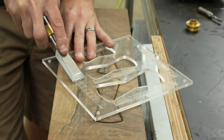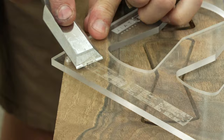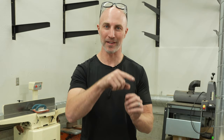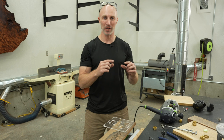I just like to have a nice flat chisel to take the tape off — doesn't scuff the acrylic and comes off pretty easy. There is an important thing to note: when you're cutting the bowtie itself it is possible to mess up using the jig — if you get a little squirrely you can cut into your bowtie and essentially need to redo it. The good news is when you're cutting your negative, the piece in your actual table, you can't really mess up with this jig, because if you slip in at all, all that's getting routed out anyway. Unlike this bowtie that needs to be a perfect outline of your piece, the negative is everything getting hollowed out. You can mess up the bowtie portion but you can't really mess up the negative portion.